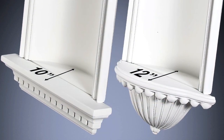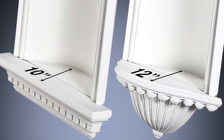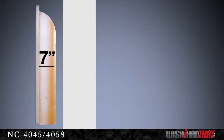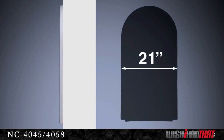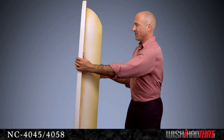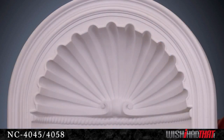As you can see, both have impressive shelf space, approximately 10 and 12 inches respectively. For installation purposes, make a note that this niche recesses back into the wall 7 inches and a 21-inch space will need to be cut out of the wall for a nice clean fit. It's installed with architectural adhesive and finishing nails, and comes pre-primed and ready to paint.